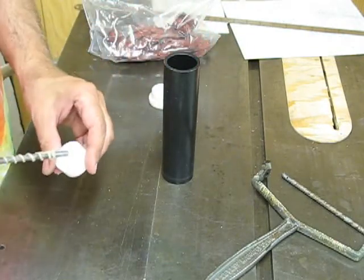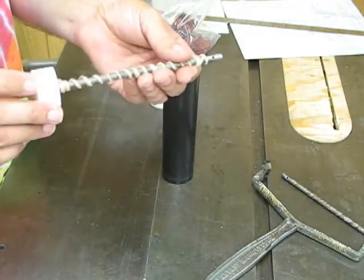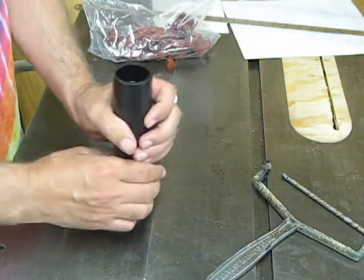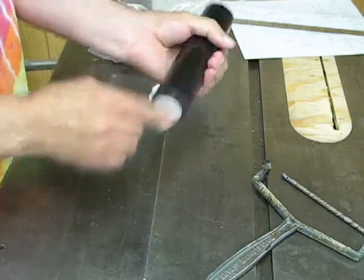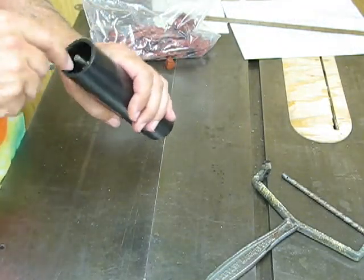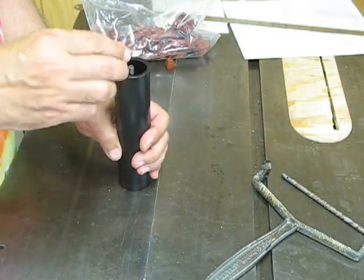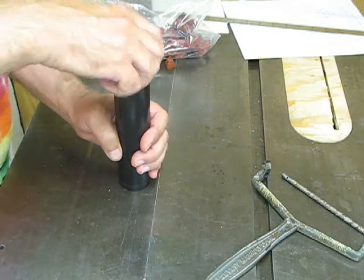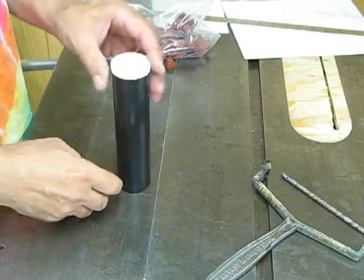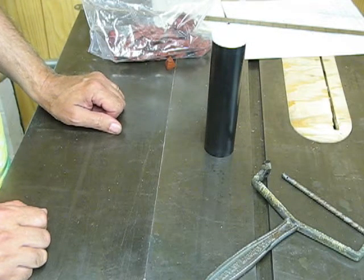To get ready for casting — this mold is custom made just for these rollers, so even the holes in the end caps are just the right length. I put the core in and it pushes in until it's flush at the bottom. Before doing that I would apply my mold release and lubricant to the inside of the tube. I fill it up slightly higher than it needs to go, put this cap on, push it down, and the excess still-molten composition would come out of this hole. I would then leave that to rest until it cools — I'd probably even put it in the fridge.